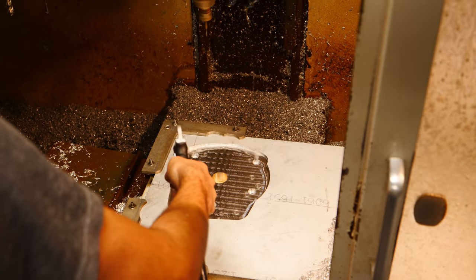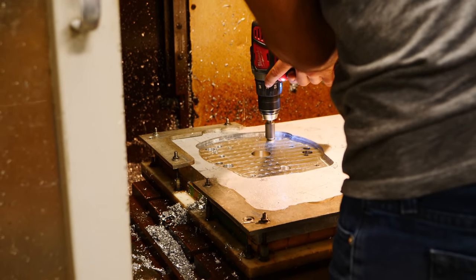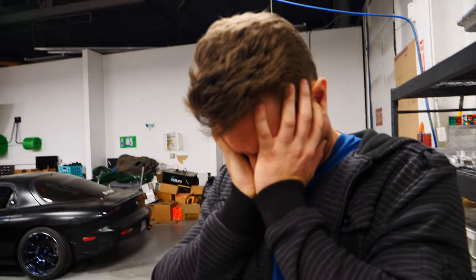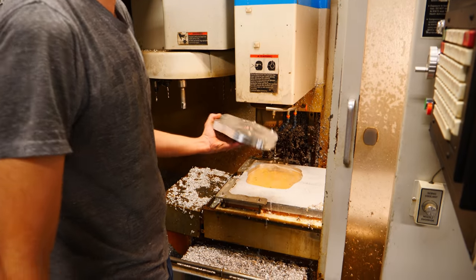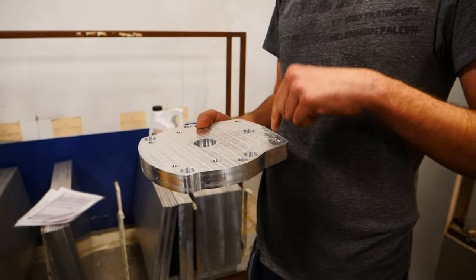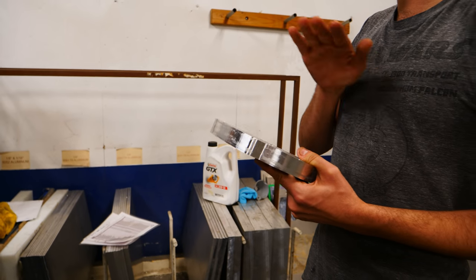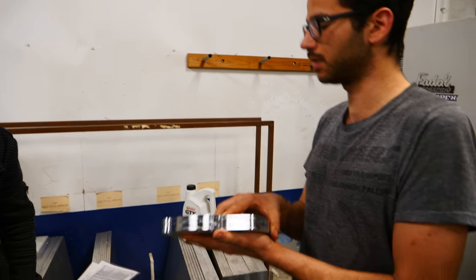Each one of those are CNC commands telling the machine what to do. When there's a problem we'll drill out a bolt pattern in the aluminum, use a cheaper piece of aluminum, bolt it down, and re-contour it for a nice outside finish. For now it's done and out of the machine — we're going to test it and see if it's even worth saving. It's fine as-is, but it has one more finish pass to go plus a chamfer. So we'll clean it, test it — if it's good we'll jig it back up, chamfer it, maybe lighten it a bit because it's heavy, and then it's done.